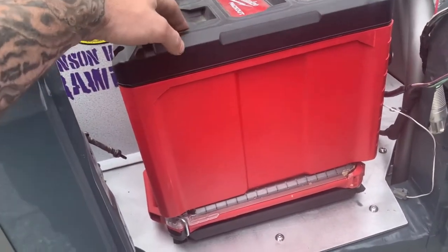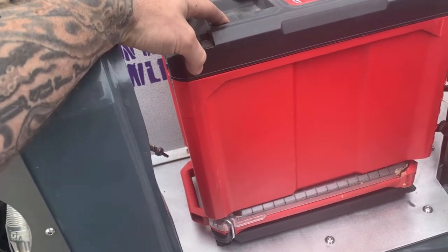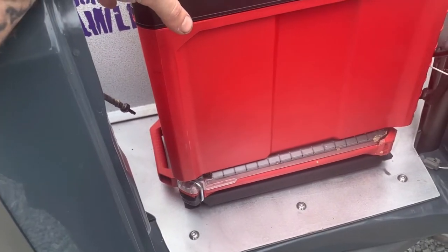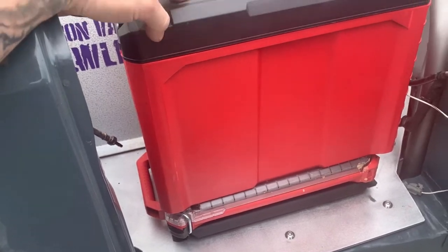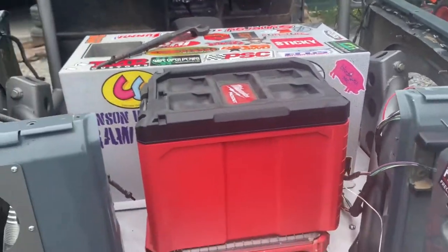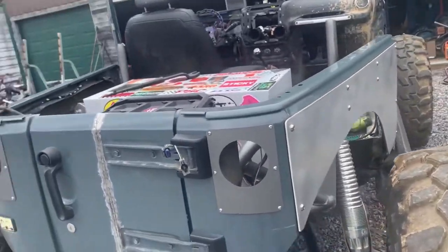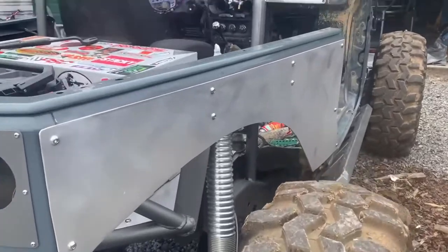It's a little loose, and I was looking at it, and it's because the plate that I got, this plate off of eBay, is made out of 1/8-inch steel, and really it needs to be like 3/16 because that's where that plate's coming from anyway. It's not awful and it's still on there, but it does bother me. I contacted the company and they said they used to make them out of 3/16, but they were so tight that sometimes it wouldn't snap in. So I don't know what I'm gonna do with that yet. Eventually I'll do something because it's gonna drive me crazy.